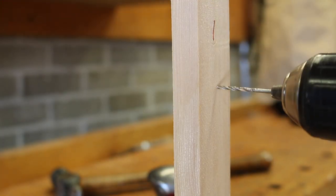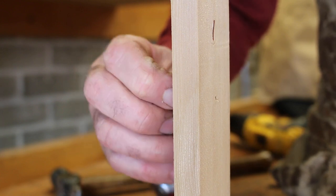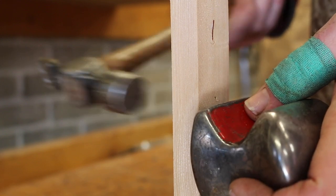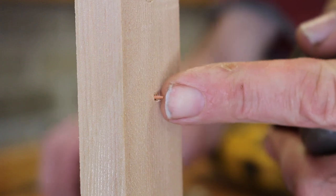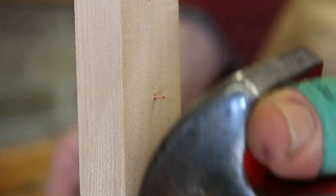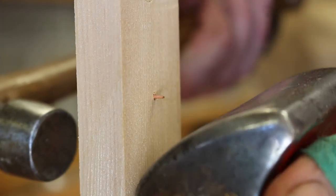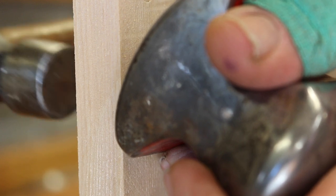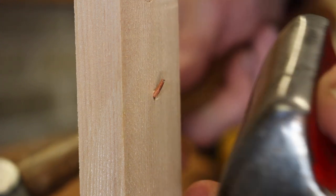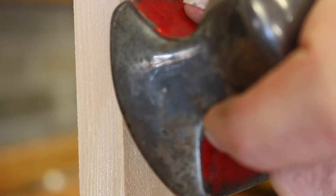What we really want to do is this. So I'm going to drill another pilot hole and insert my nail just as before. You put your iron on the plank where the nail's coming through, but you want to leave that hole exposed for the moment. We're just going to tap until a little bit of nail is showing through — about an eighth of an inch. Now in the direction I want this to bend, I'm going to bend it up. I'm going to put my iron against it — this is just an automotive dolly — and angle it up fairly steeply. I'm just going to give this a couple of gentle whacks.